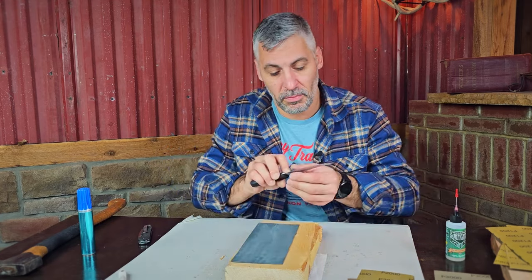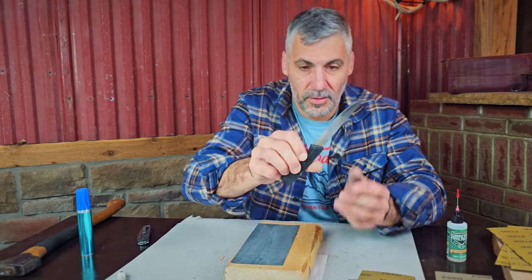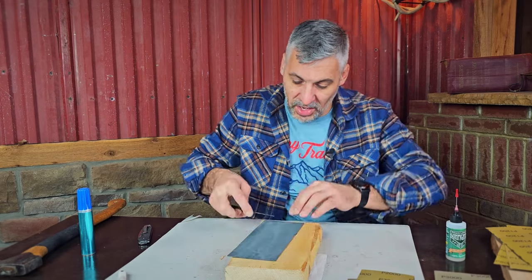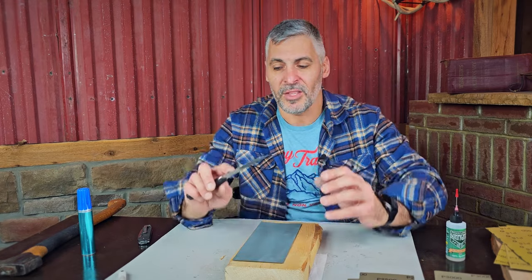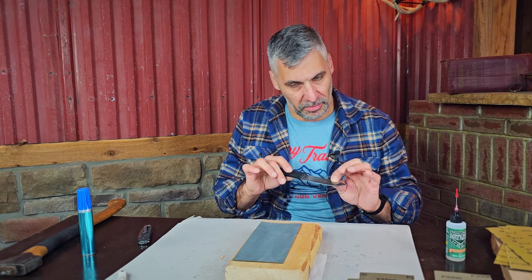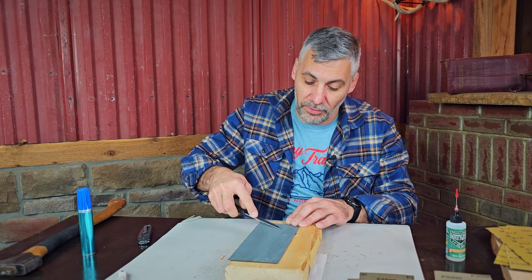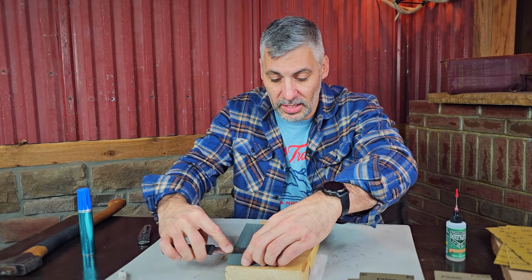I'll pull that box out once a week or two while waiting for coffee to brew, take that knife, 1,200 grit aside, 1,500 grit on board, and get a couple passes done. It just ensures that when my knife comes out, it's good to go — when I need to cut something, it's ready to go. The angle of the bevel is something you learn. There's a lot of knife sharpening equipment out there trying to help the user keep the right angle. Through practice you'll sort it out. If you didn't learn how to sharpen a knife as a young person, now's the time. If you've got a son or a daughter, teach them this — you don't need fancy things.